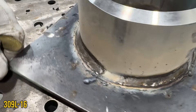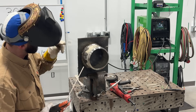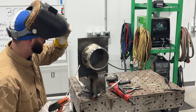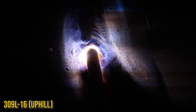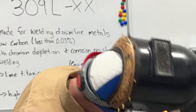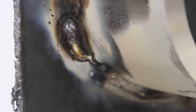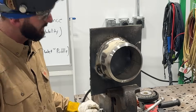Now we're going to put it up on its side and try to climb uphill with both rods to show what happens. I'm just going to weld this vertical piece because I believe that's one of the hardest welds to make with this rod. This is the dash-16, so we should have all-position capabilities. We've got it down to about 100 amps. The hardest part is to not pile up a weld in the center and get a big tall belly on it. This rod already wants to dig a hole to China — that's not what I want.